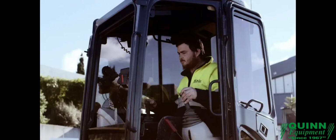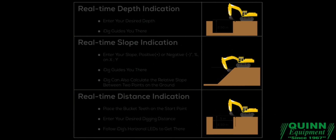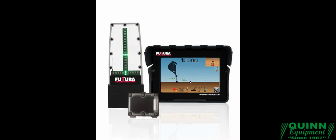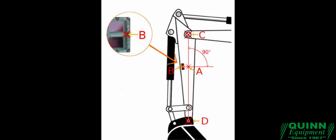Use window cleaner to clean both the glass and the suction cup mounts to achieve good adhesion. Attach cables to the LED and control box cradles. Secure the cables with conduit, cable ties, etc. Do not plug in power until after the 2D sensor is installed.